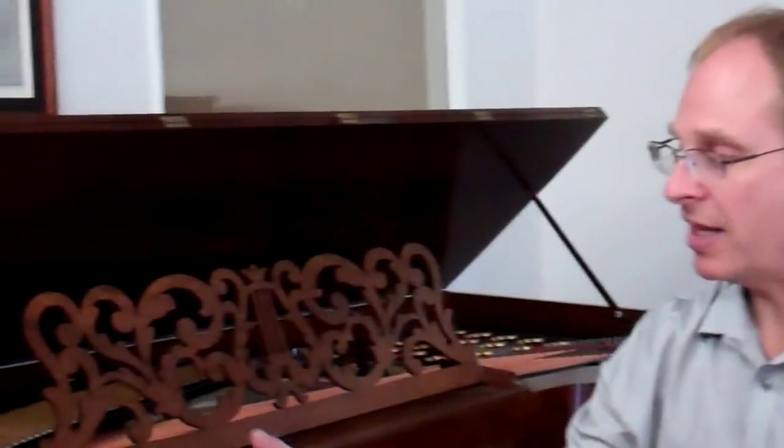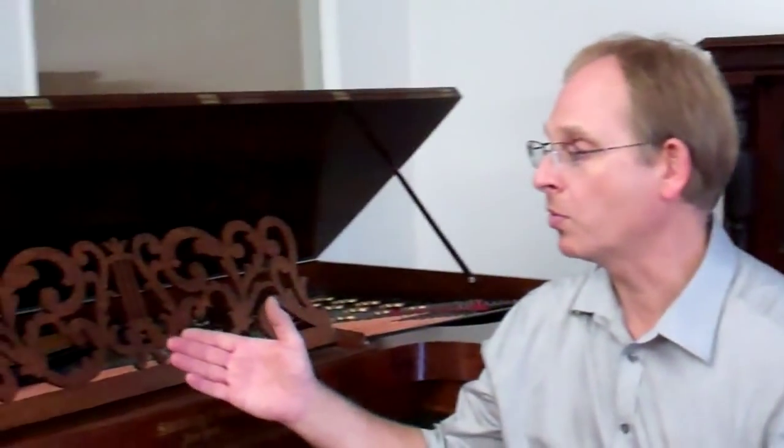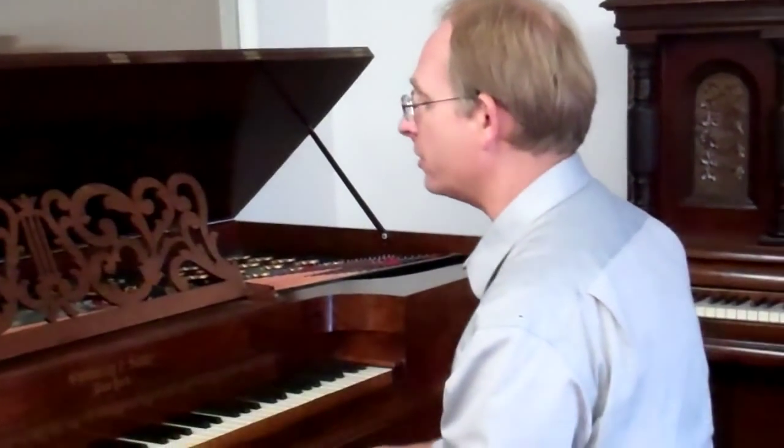By the time the piano evolved back to the full modern grand, Steinway still, I think, felt that this damper arrangement is almost necessary for squares because of the geometry of the square. The point at which the hammer strikes is right over the key bed, so there's no simple way to put vertical damper wires other than in some sort of leveraged frame like this. But with the more modern grands, of course, modern piano actions typically rely on small vertical wire dampers that are perhaps weighted or sprung, but much more simple in their mechanics than these for squares.